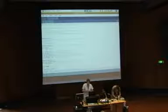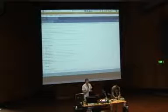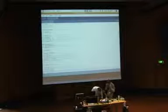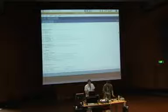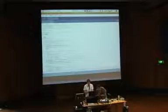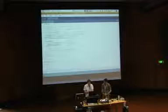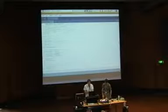Okay, so this is an example that I actually just grabbed off someone's blog. It's a project, as I said, to read a value from an accelerometer that's inside the nunchuck and then control the position of a servo motor. And it's relatively straightforward. Basically, we're just specifying, once again, what pins we want to use for what purpose. Servo pin, pin 7. That does not sound right because pin 7 is not a PWM. Oh well, we'll see what happens. Oh, it's probably just doing a square wave thing. Okay, so what we're doing is, in a little loop, we're reading the accelerometer value from the nunchuck, and then sending different values. What have we got here? Pulse width. Yep. So we're sending a variable pulse width to the servo.